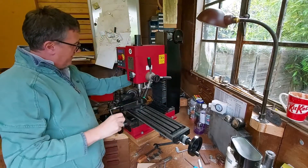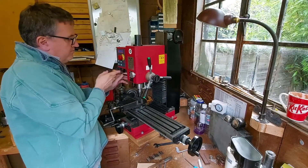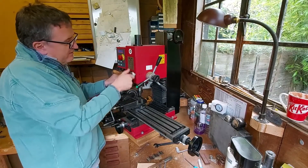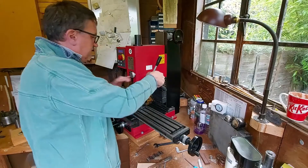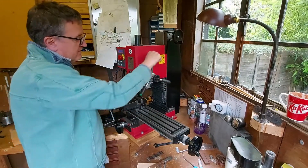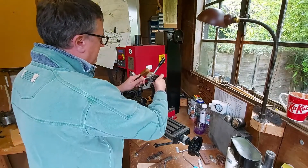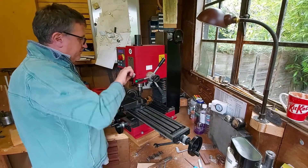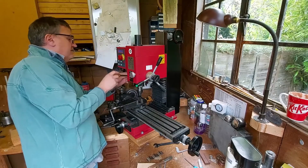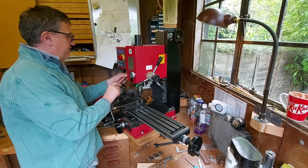We also have a scroll that allows us to move the spindle up and down, or we can unlock the spindle and then move it like with a drill attachment at the side. I tend to leave it locked, as I'm often using it on a fine feed. On this side we have a lock for the actual scroll — that Allen key fits in.